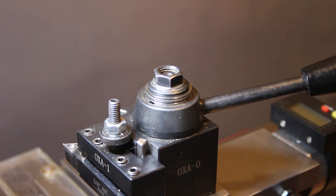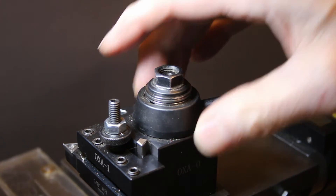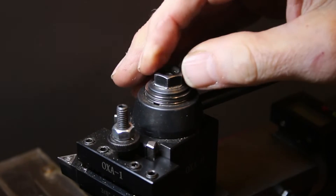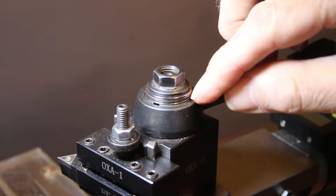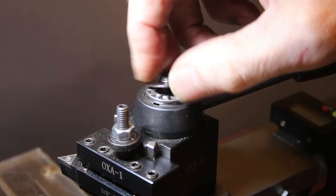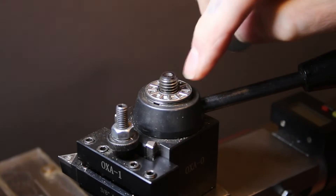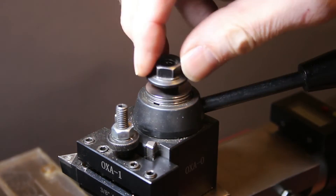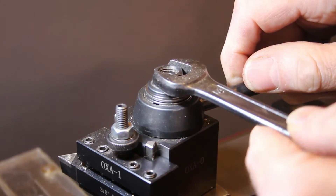Another small improvement I made was to put a thrust bearing beneath the nut that tightens the tool post down. You're often adjusting the angle of the tool post and repositioning it, and so every time you're moving this nut back and forth it would start chewing into the aluminum or metal. This is a needle bearing type thrust bearing — it comes with two precision washers. You can see the needle bearings right there. That makes the whole force transfer much easier — it actually just makes the tightening process a little more easy to do.